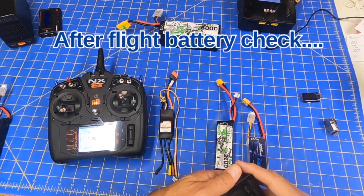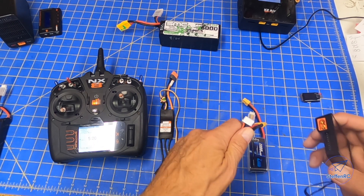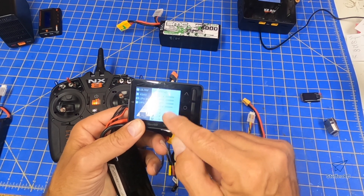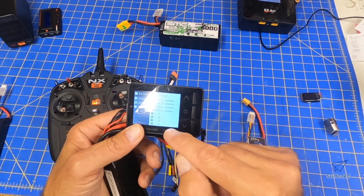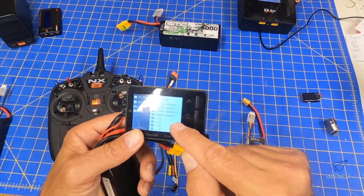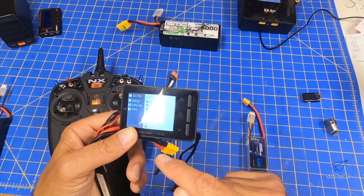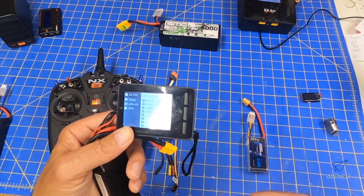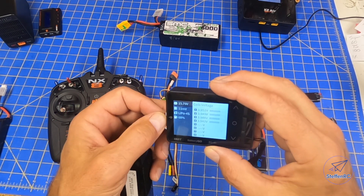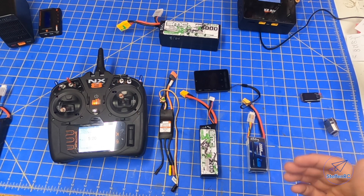When I'm done flying, on certain planes I'll have telemetry that shows me how many volts I have, but it doesn't give me all the details. I like this system here because after I fly I can take a look at all of those cells and see if one is really not performing as well as another. Here you see cell number four is a little less than all the others — it's not in a range that really concerns me. If all these were at 3.9 and that cell was at 3.7, that would be a big concern, meaning this battery is causing issues, and I'd probably put it on the no-fly list. It's something I do after I fly to check the health of my batteries.